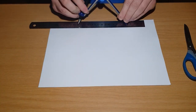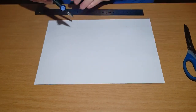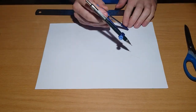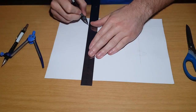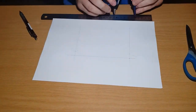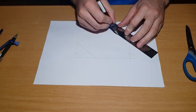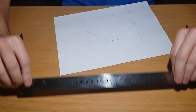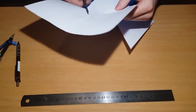The first step is to make a paper template to transfer the antenna dimensions onto the metal tin. This is done using standard drawing techniques with a compass to draw arcs, distances and perpendiculars, a ruler for measuring distances, a pencil to draw, and scissors to cut out the template. Note, the tip to tip dimension is 140mm, and the width is 100mm.